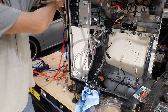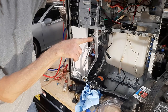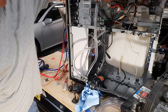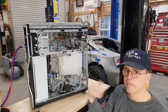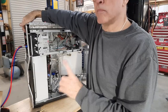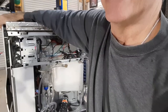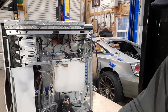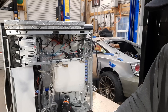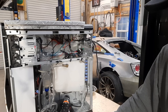Let's see what happens. The bigger this accumulator bottle is, the less the pump would cycle off and on. But it does work. Let's give it a test. You can see the water going into the accumulator bottle. And there you go — now the pump will cut off.